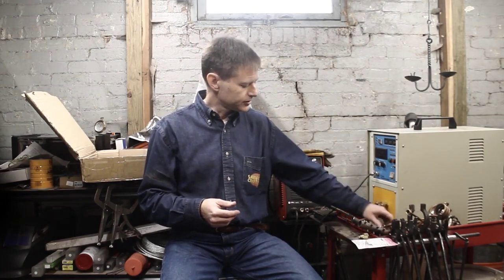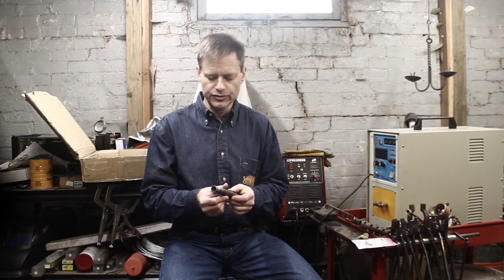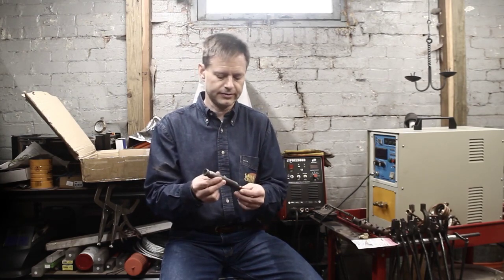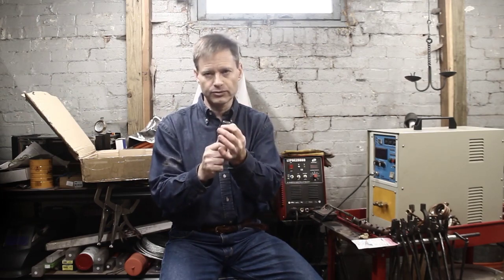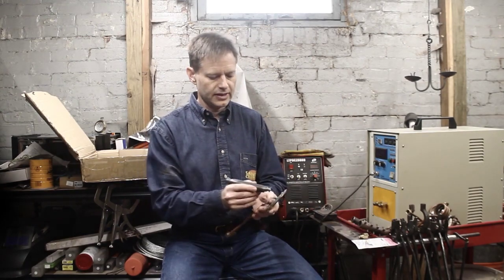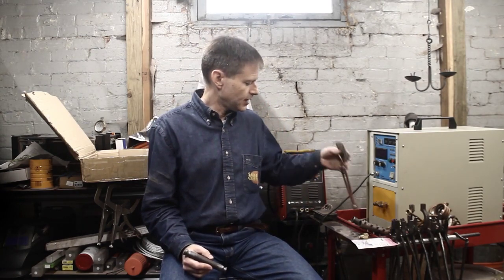When I'm freehand making coils, I use this — a little bit of half inch inner diameter black pipe — and I use my guillotine tool or maybe a little tiny spring fuller I made out of some quarter inch stock. This is set for six millimeter slash quarter inch, and I did two sides of it, so the groove really supports the tubing so it won't collapse on you. I cut a bunch off so that I can do some tight corners. I was going to make one of these, but I bought this one from Metalworks.